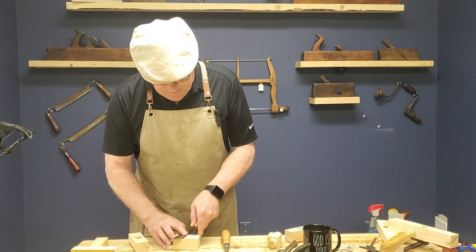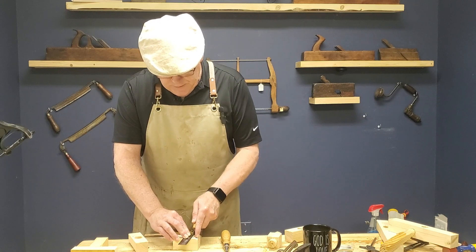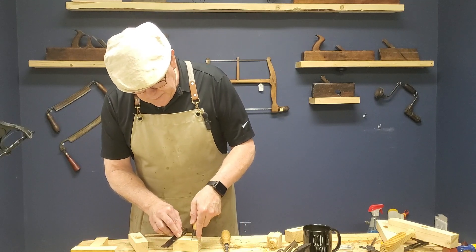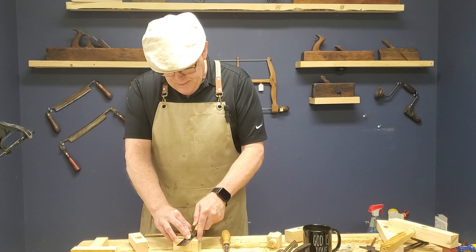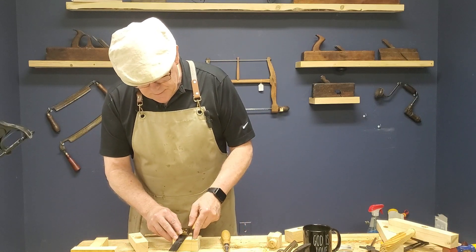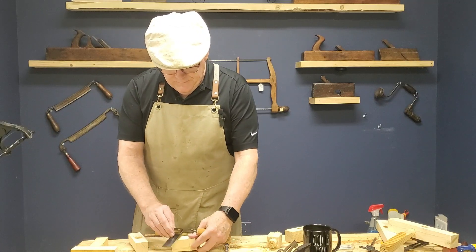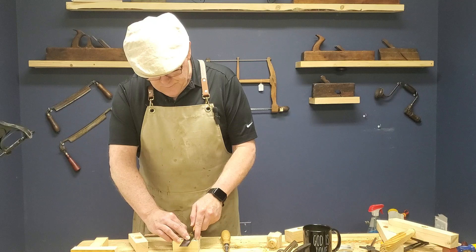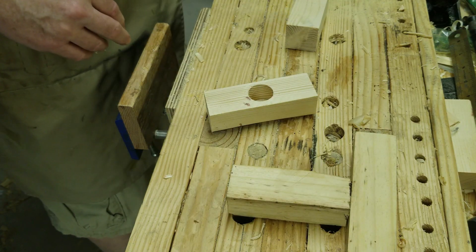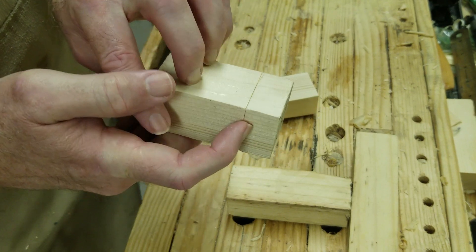We will put the marking knife right here up against that and we will score — one, two, three. Rotate the piece of wood, put the blade in that nick and then present the square to the blade. Rotate it again, knife blade in the notch. And one last time, knife blade in the notch, square — one, two, three. If you do it this way, you are much more likely to have perfectly matching lines all the way across.